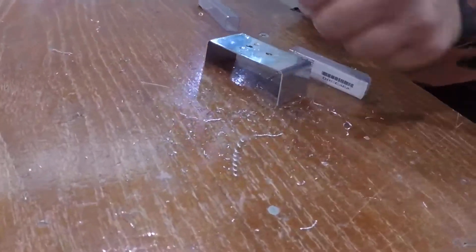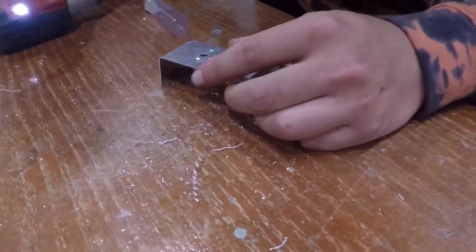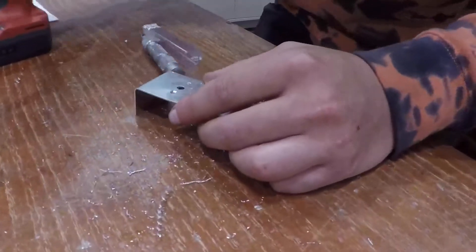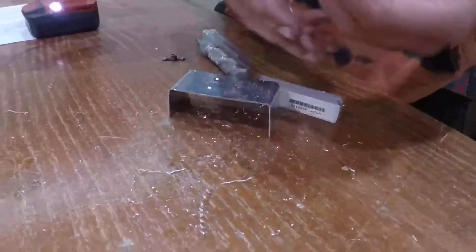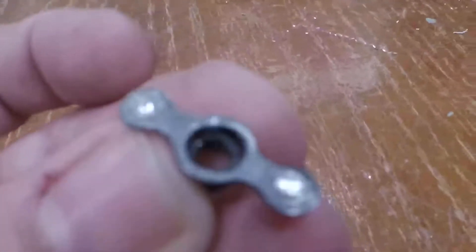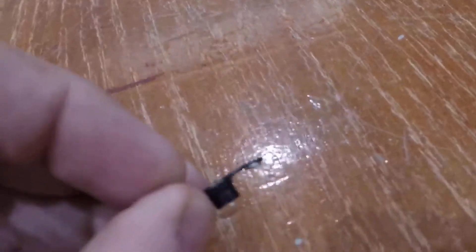He should be able to take his punch. The nut plate was removed and the heads came off. You can see here in the nut plate that the shop heads of the rivet are still in there. He could probably pull those out — my guess is you can punch them out or maybe pull them out with a little needle nose. If he had to, he could drill a little bit more right there to get those out.